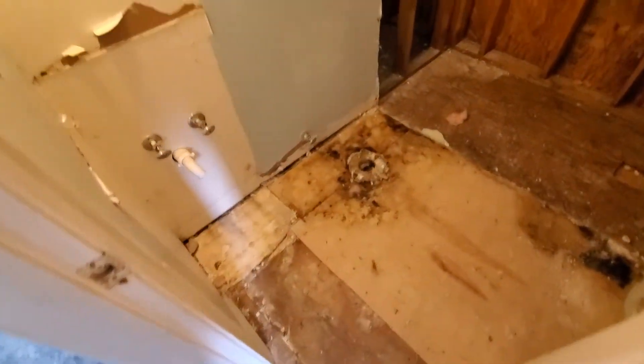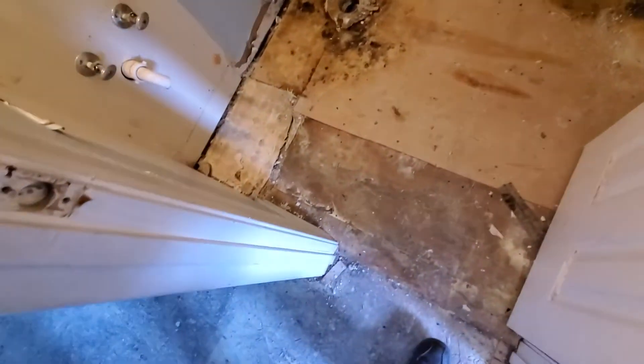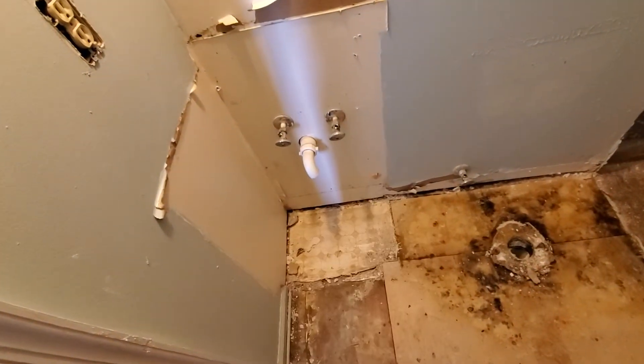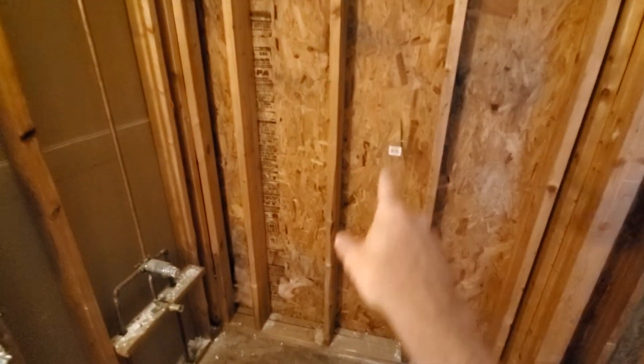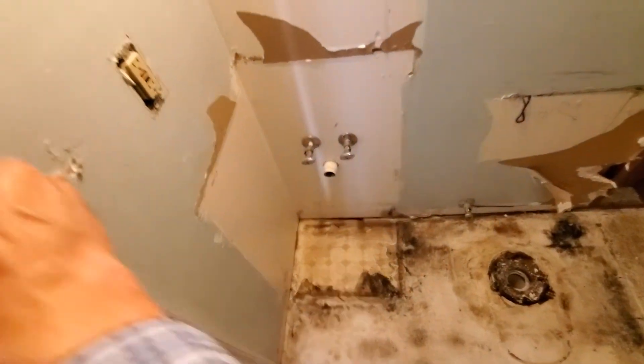They removed all the shelving to give us a nice bedroom space. The bathrooms have been demoed and came out really good — no wood rot, no soft floors, everything's solid. We still need to remove this thin blue one here, but again this will be one continuous floor all the way into the bathrooms. This bathroom is going to have a shower tiled all the way to the ceiling, then commode, and unfortunately just room for a 24-inch vanity. Both bathrooms will have a tall niche on the back wall.